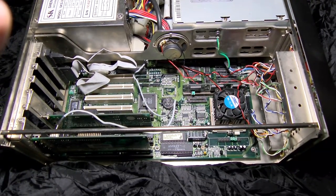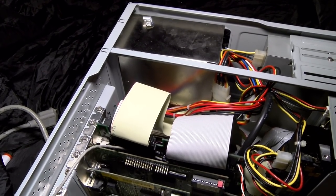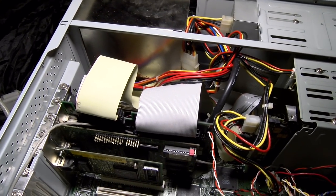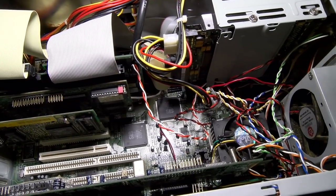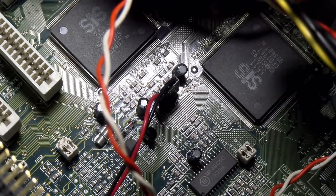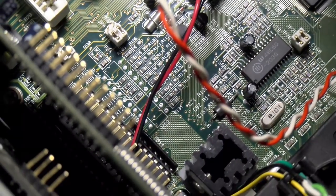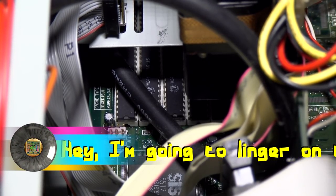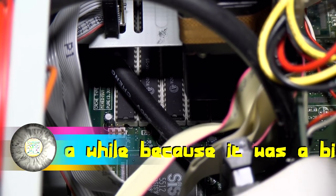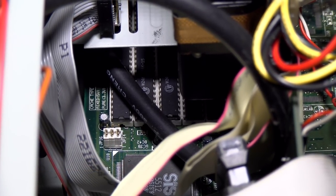You may think this board looks similar to the ECS SI55P in my current K5 system, and you'd be right — it really does, and it's one of the reasons I chose that board. The ECS does not use barrel batteries; in fact it doesn't offer any onboard battery at all and simply has a header for an external battery. Furthermore, it doesn't offer a COAST slot and you're stuck with DIP RAM on here. Otherwise, they're mostly the same in features and specifications — the ECS seems to have been made just a little later. I do have twice as much cache installed on the ECS, but they're 20 nanosecond chips, so we're going to have the latency turned up just a little bit.